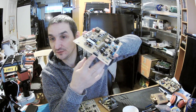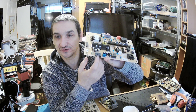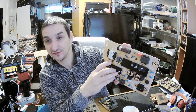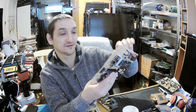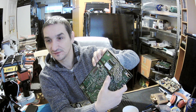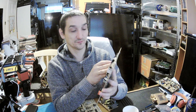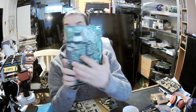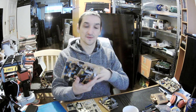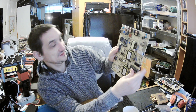Do we have any driver? Because that's another DC — AC to DC bridge rectifier — yes, of course. Here is the driver. This could be the backlight driver. There are two — one and one here. So this one would be the backlight driver. So many similarities. And that's the same reason why there are two transformers on this one.